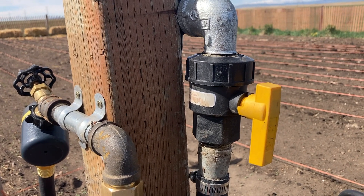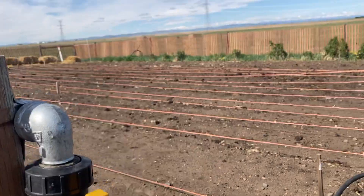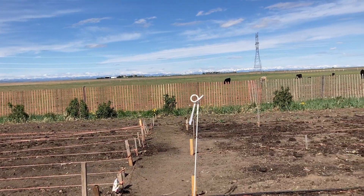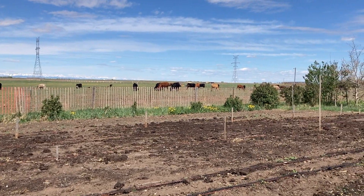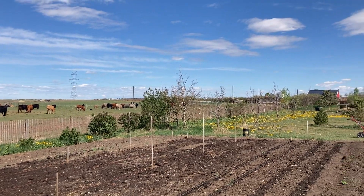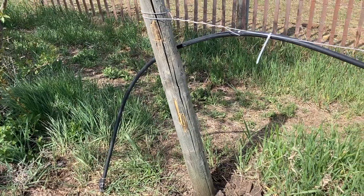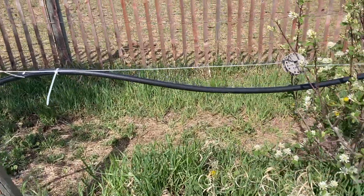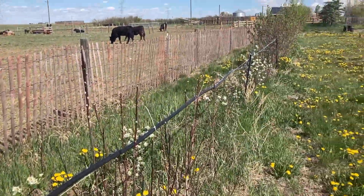So that's how we're running the whirligig right now. I do have some half-inch black hard rigid pipe — you can roll it up, it's not that rigid — but I got some 1/16th-inch holes drilled in it and I have that over my saskatoons over there. I can just turn that gravity feed onto that and they kind of drip out of there pretty good.